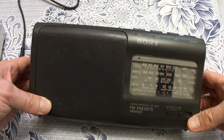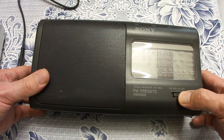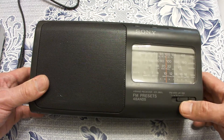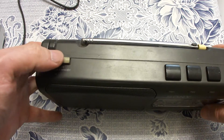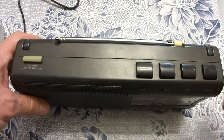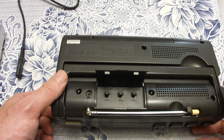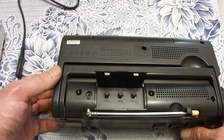Comparing to this, I have here my old Sony radio with only 4 pre-selection buttons. The good thing about this radio is that it also has medium wave and long wave — other bandwidths you can select. The second advantage is a true on/off switch. With this switch you can completely turn the radio off and it draws no power at all. And the pre-selection of stations is done using potentiometers — variable resistors — so it doesn't matter when you take the radio off power; it won't lose the pre-selected stations.